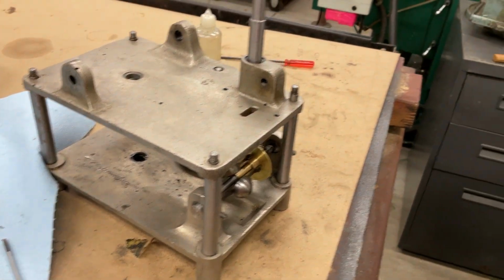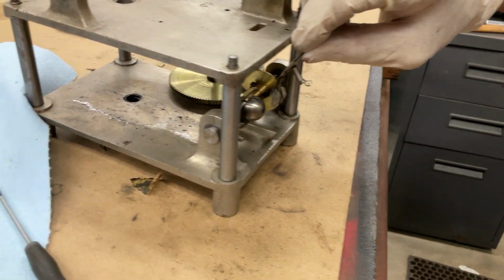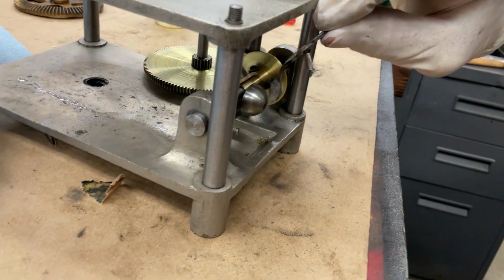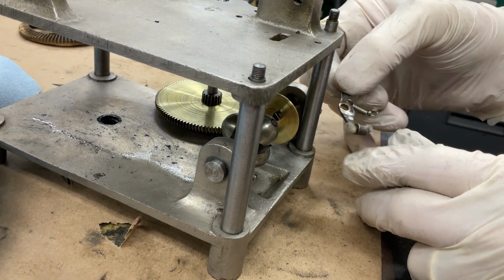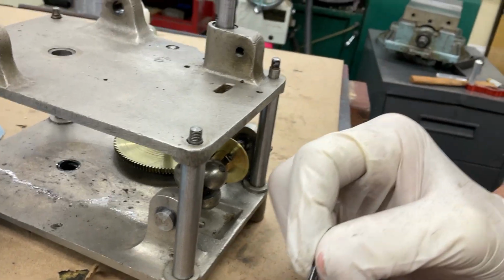when we mount this piece in, this is going to be running right here. And you want this felt to be running smoothly against this governor back piece. It's always critical that this is polished out and the ends of these are clean. I have videos on how to do all this, and that'll make your machine run a lot faster and better.